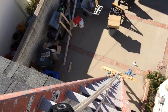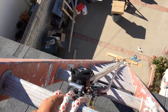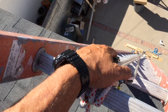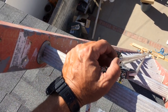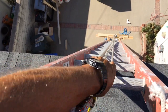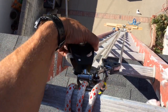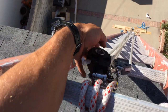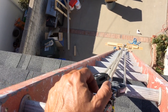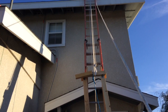Just run the line across your backyard, then have a line that you take up to the roof and haul this portion into place — so you don't have to rig that on the ladder in advance. When it gets up here, make sure these lines are untwisted. Here's a kind of untwisted state, but when you first get them up here they're going to be twisted, so you just untwist them with their partner pulleys down below.